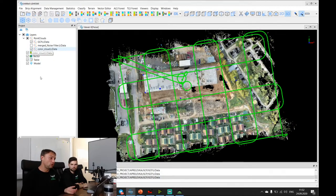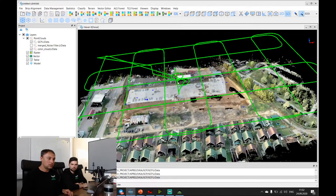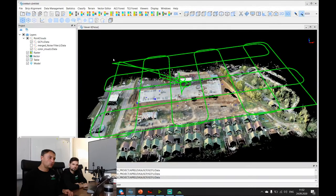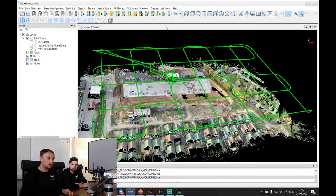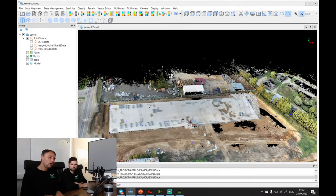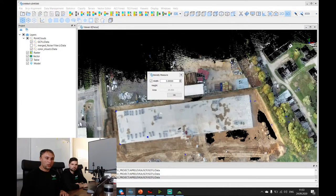Here you can see the calibration of the IMU, and then we go for the survey mission, and we just use cross lines to generate point clouds. We used 30% overlapping in order to ensure photogrammetry data processing, to make aerial triangulation to colorize point clouds. But if we don't use a camera and don't need to colorize point clouds, we can fly easily with an overlap of 10% definitely. And let's check point cloud density.